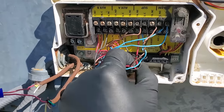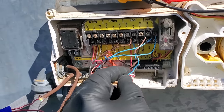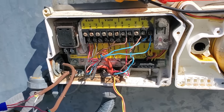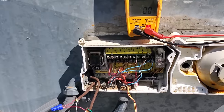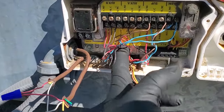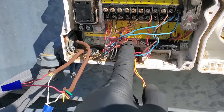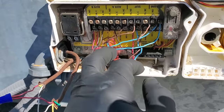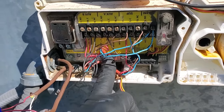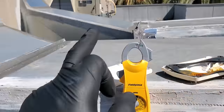This red jacket is going strictly to the test and reset station — it's using four wires and that station requires four wires. So we can mark this as test and reset number one and figure out what colors go to what. We can completely unwire this and figure everything out — that's how I break them down and it makes a lot more sense. Then I can look at the next jacket — this black jacket right here has one wire going to the power source and then going to the alarm contact. This is the fire alarm company's wiring, landing right here and running over to the other detector.